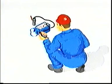Before you start the operation, check that all tanks are properly inerted, which means that the oxygen content in each tank must be lower than 8%. Measuring the oxygen content, you find it okay. There is an average oxygen content of 3 to 4% in the tanks, so it's safe to start cleaning the vessel.